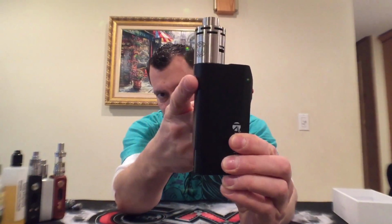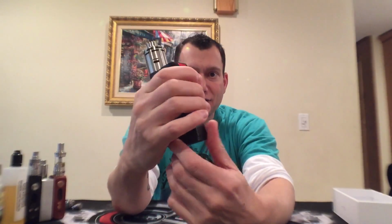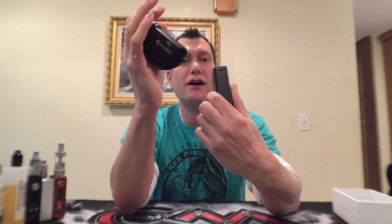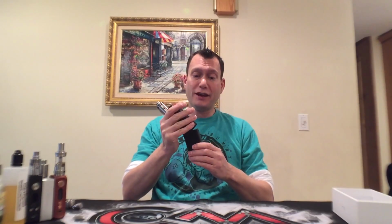As you can see, it's got a cool ergonomic hand grip, and this was inspired by gun enthusiasts. So you hold it and it's a clip. It's a 4,500 milliamp hour LiPo pack battery. This is a triple series, 3 cells, 1,500 milliamp hours each, and this is what's used in remote control airplanes because it can handle the volts and the amp pull that powering a remote control airplane needs, like a drone type of thing.